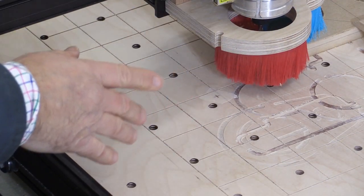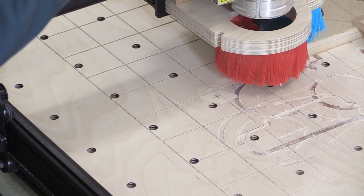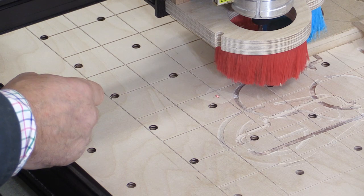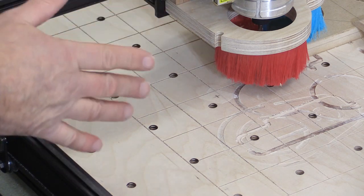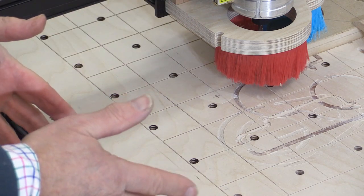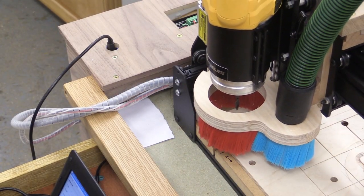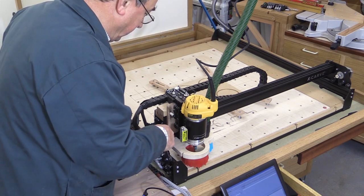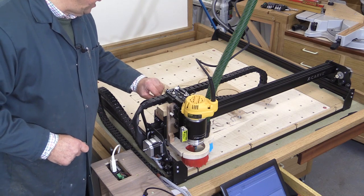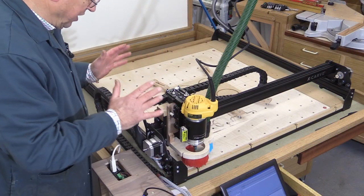When I first set the machine up for this job, I put a little crosshair here where my laser goes, and the machine's now done all four of those cuts. I've just checked — it's returned to the same position as far as my eye can judge, so I'm really pleased with that. That's a good indication at this stage. I'm now going to get the machine to go to its home position, and we'll just see whether all our little green lines are lined up. The machine's gone into its home position, and my green line is lined up here. I can see the one on the Y motor over there is in the upright position, this one's in the upright position, and the X is in the upright position. I've also got my laser and I can check my home position as well — all of those things are absolutely spot on.